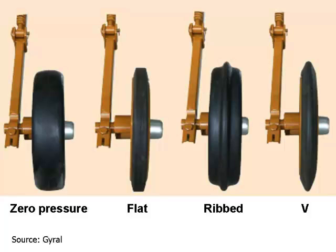And it probably doesn't have to be to the millimetre, but if you've got a narrow point, use a narrow press wheel, and try and match up the millimetres, the widths of that equally. Some people are a bit worried about a narrow press wheel, narrow point, having a big trench, but I think that's actually good in sloping ground. It actually keeps that water in that furrow. We'll talk about layout later, but it just keeps that water in that furrow.